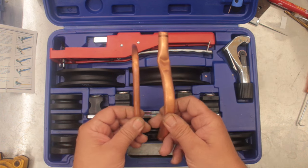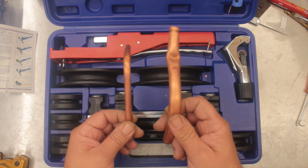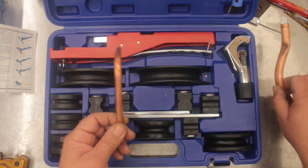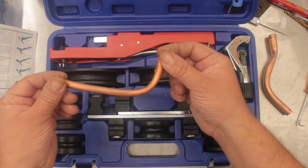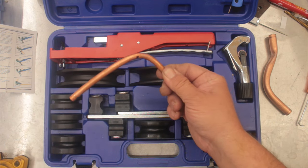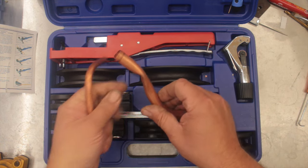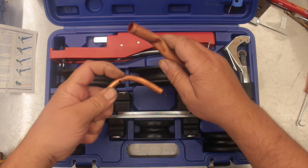I've got two lines to run and they both have nine 90-degree bends in them — some bends go this way, then this way, then this way. That way it allows you to form and bend the pipe without distorting it, especially on the angle. Once a pipe is distorted on the angle it's pretty much no good — you can't bend it back to straighten it and the strength is not the same as on a nice bend.